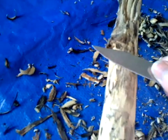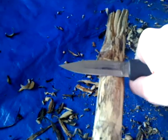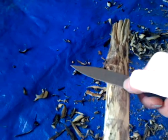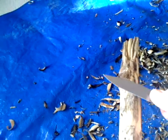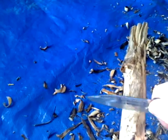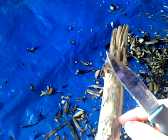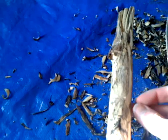To carve towards yourself is very dangerous — don't do this carelessly — but make a slight angle and carve toward yourself. It helps if you saw: start over here and slide the blade towards the tip as you're carving, and that makes those nice little swirls. Or you could just come straight back, but be very very careful. That's why the ridge is here. You'll slowly create a tip starting from here, whittling all of this down into a point, then snap it off.